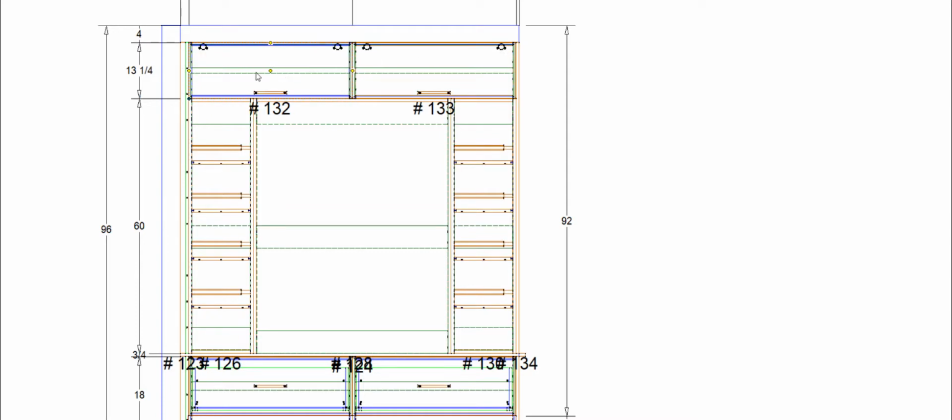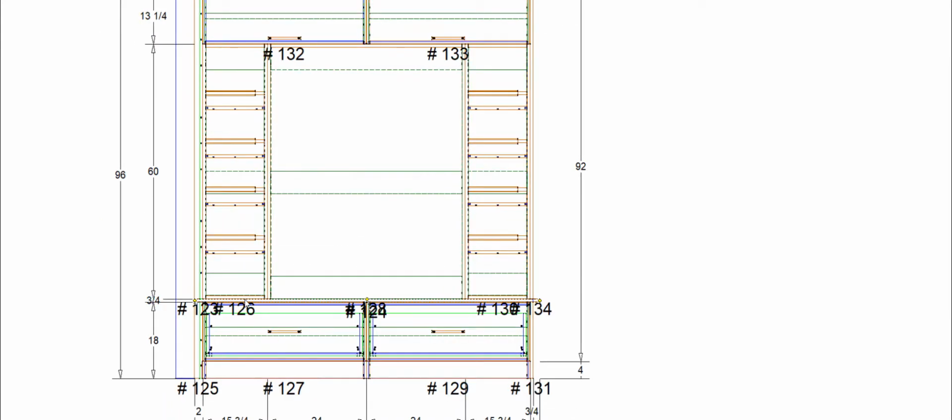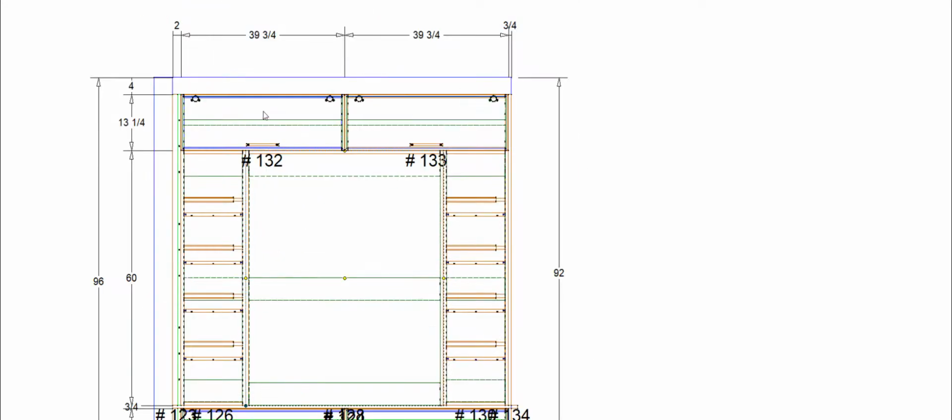Okay, so that brings us up to our nominal height. So let's just say that the ceiling height minus our 4-inch air gap, let's call that our total cabinet height. Essentially 92 inches. We want the combination of a good double check here before you put your order in. Make sure you got your base cabinet. That one's 18 inches plus 3/4 for the finished top. Then we got our shoe shelf or the alcove cabinet, whichever one you want. And then we got our cool flip-up cabinet. Okay, the combination of all of those guys should equal 92 in our case, because 96 with a 4-inch air gap.